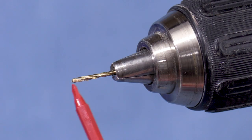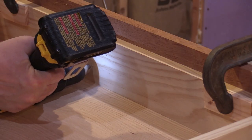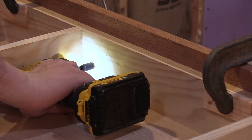I've put a 1/16th drill bit in my drill and set it so that it will only drill this far. I'm drilling from the inside. Because of the way I set my drill bit, I can be sure that I won't make holes in the outside of the mahogany. Then I can put short screws in for some additional support.